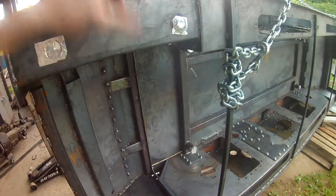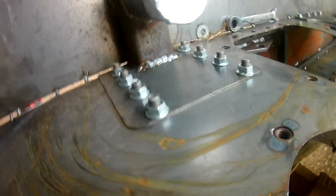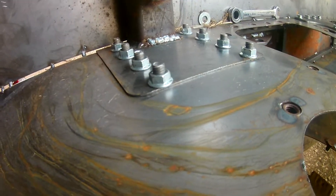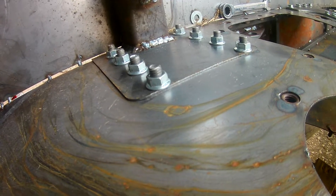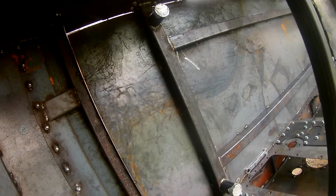From a chain standpoint, there are the gaps going on, and I'll probably be thickening the plates that mount the bolts on the chain boxes. That's only a sixteenth-inch steel right now — that'll probably get changed to three-sixteenths just to make it a little more rigid and stiff, so that when you bolt this thing together it just clamps right down.